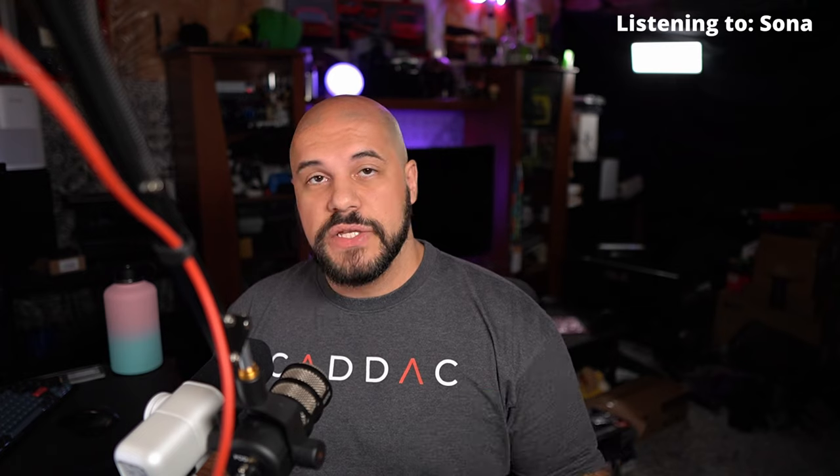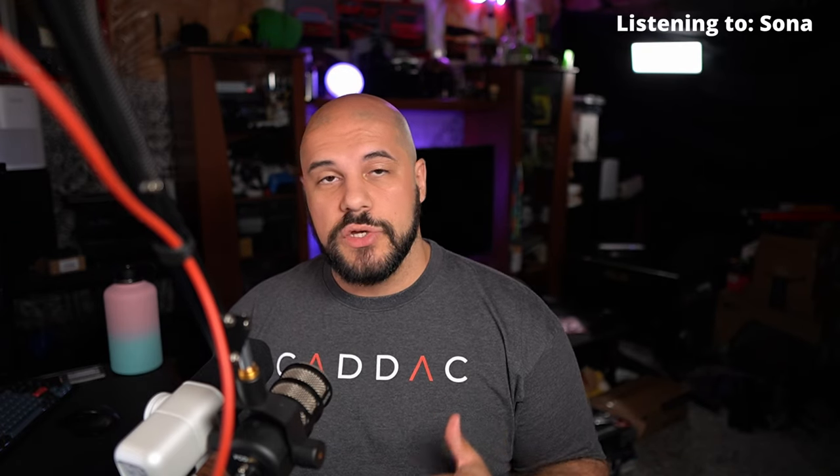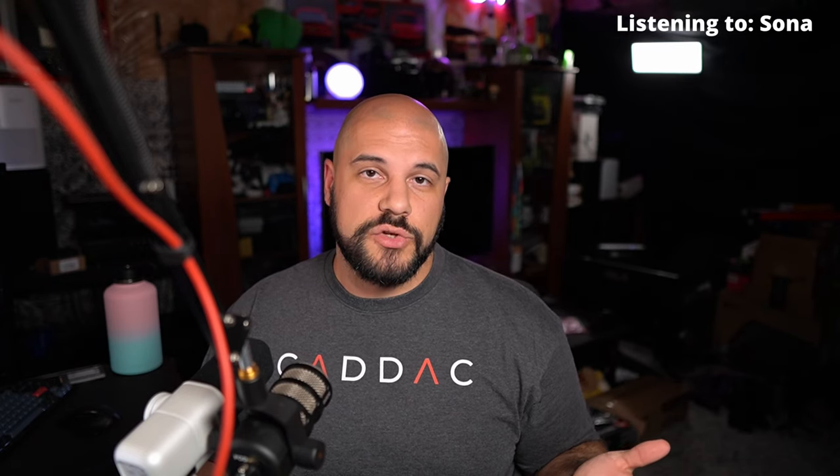The mic looks good; I like the way it looks. One of the biggest features and selling points of the Blue Sona is the fact that it has that inline preamp — what they call the Clear Amp. It was a huge selling point when this microphone was announced, and it's how they justified the pretty hefty price tag. It was its big uplift over the Shure SM7B, because a lot of people using the SM7B required having a cloud lifter in order to get enough power without having to boost gain crazy on their mixer if it didn't have really strong preamps built in.